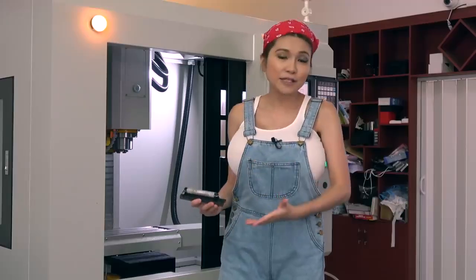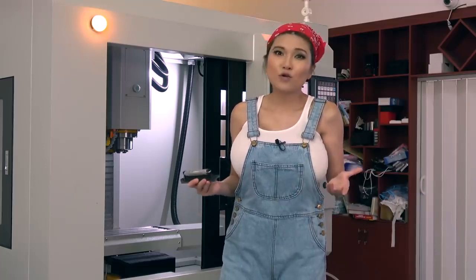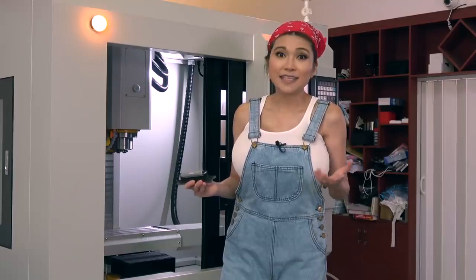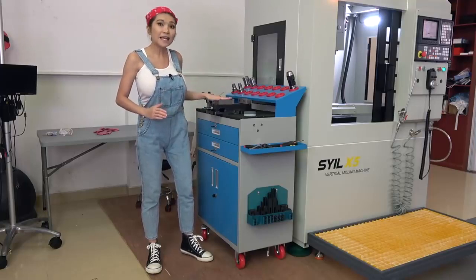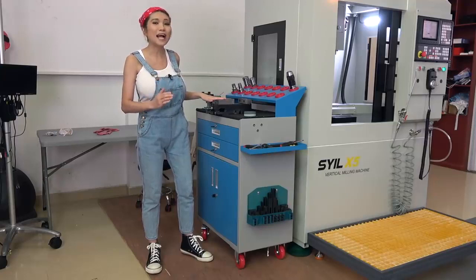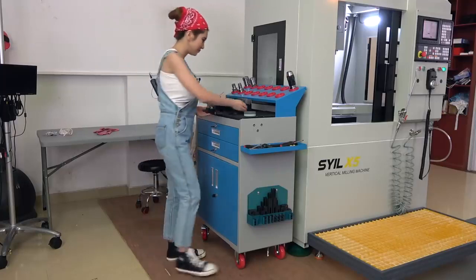It's not absolutely perfect, but it's good enough for now, because I am going to have to re-level it in a couple of days anyway, once the machine settles a bit. I'm going to install this vise and then tram it. I learned how to do this through a Titans of CNC tutorial, which I'm going to link in the description box. But any mistakes I made are mine, not theirs.